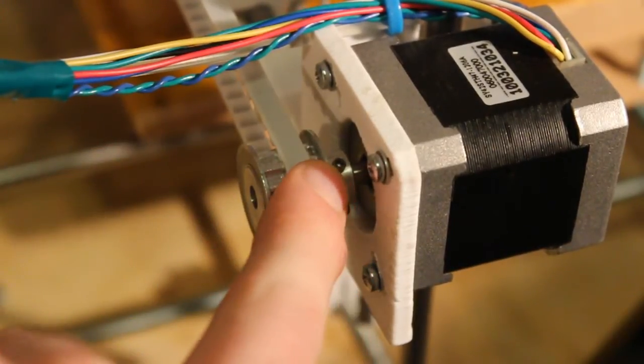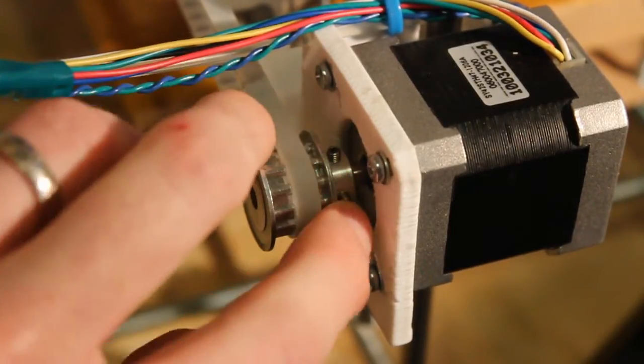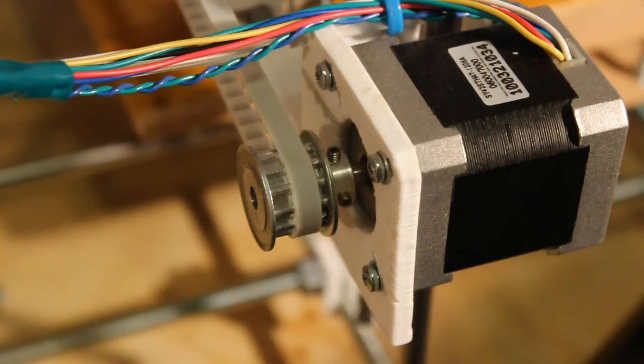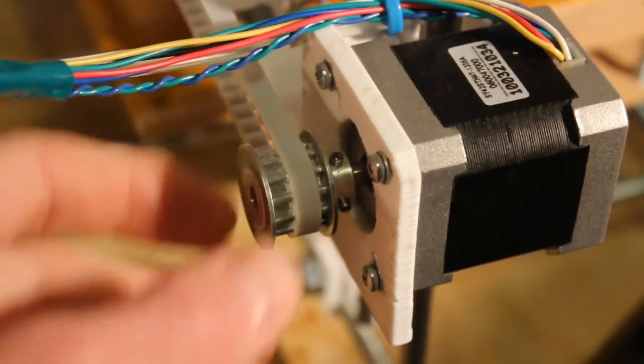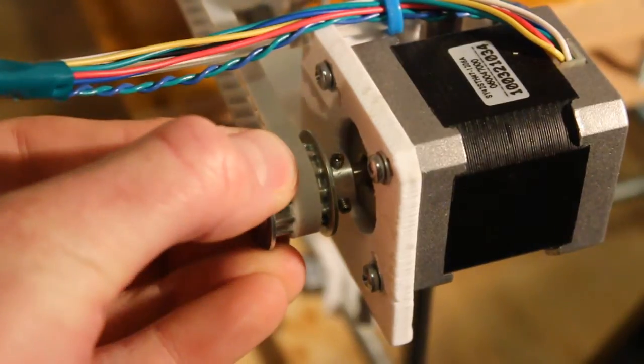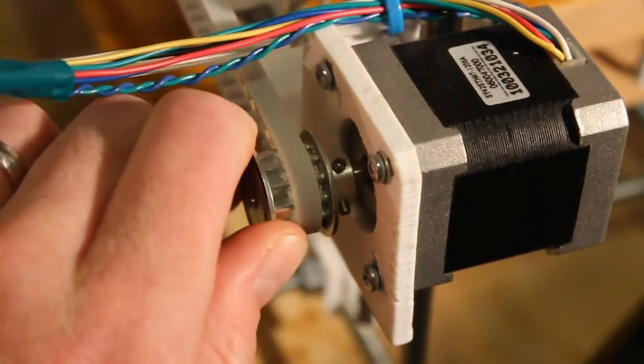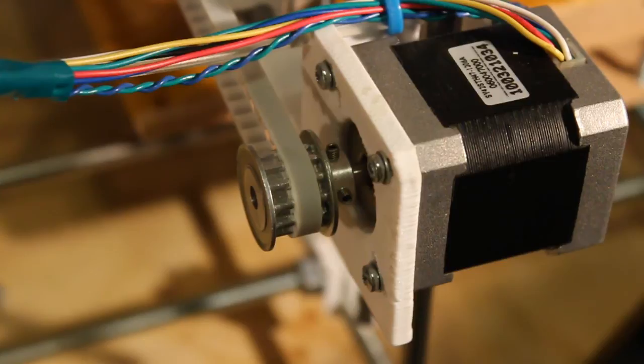And then I've got two grub screws on each of the pulleys, set out by 90 degrees so that it grips on. One of them is onto the flat and one of them is onto the side of the shaft to give maximum grip and make sure there's no slipping on the motor shaft, because that was my biggest cause of backlash. It wasn't actually the belt tension, it was just the pulley slipping on the motor. It can't do that now, so it's a good strong fit, and that's certainly improved the reliability when it's doing lots of backwards and forwards